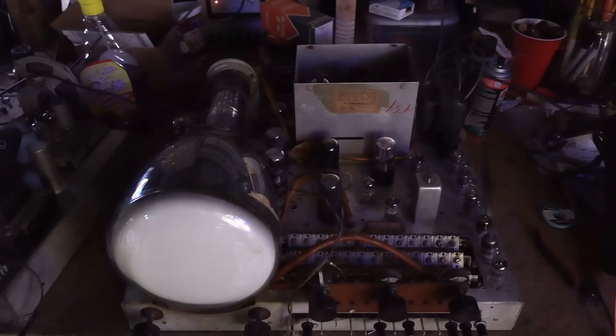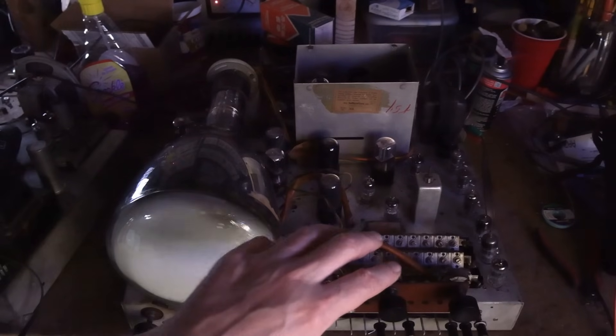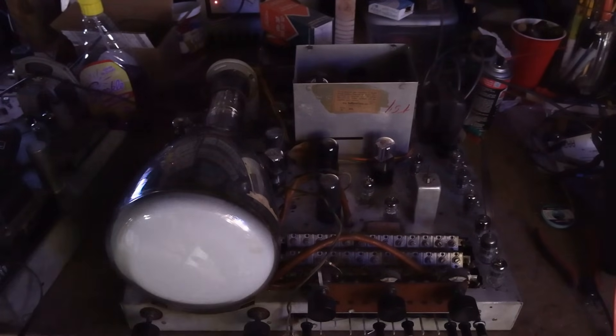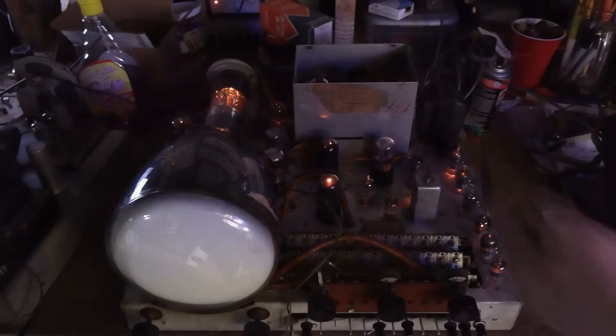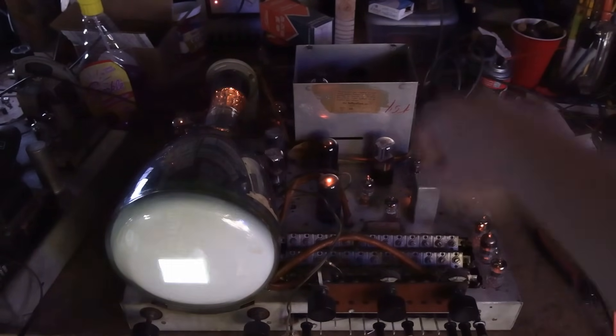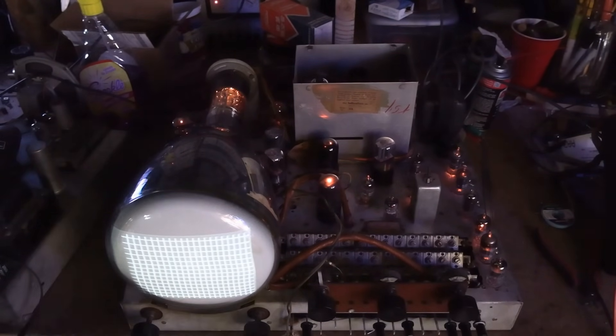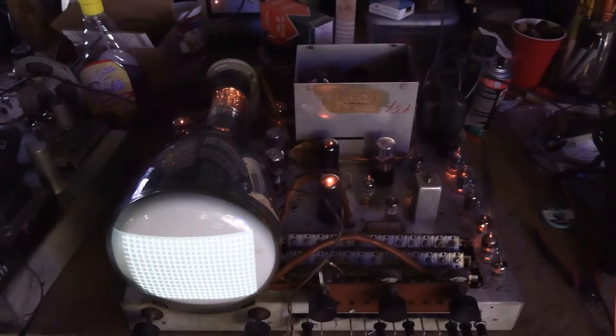Let's see what effect that thermistor has. I'm going to turn the set on — we want to watch the tube filaments. It should take a little bit longer to warm up than before, but we should see less of any bright hot spots. Some of these tubes have less shielding so the filament looks brighter — that's okay, we just don't want to see any real bright flare-ups. Before, that 6AL5 just lit up bright white. Same with the 6C4 inside that high voltage box. And here comes our CRT. I think it's working pretty darn well. If it wasn't for that slight vertical linearity issue — which honestly isn't that bad — let's take a look at it again. I don't think it's really that noticeable.